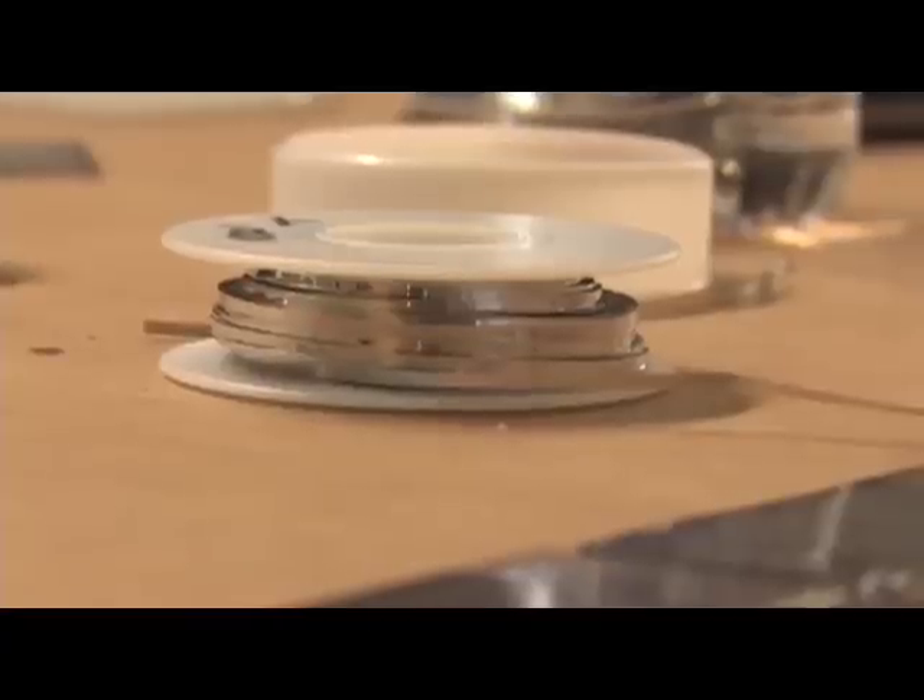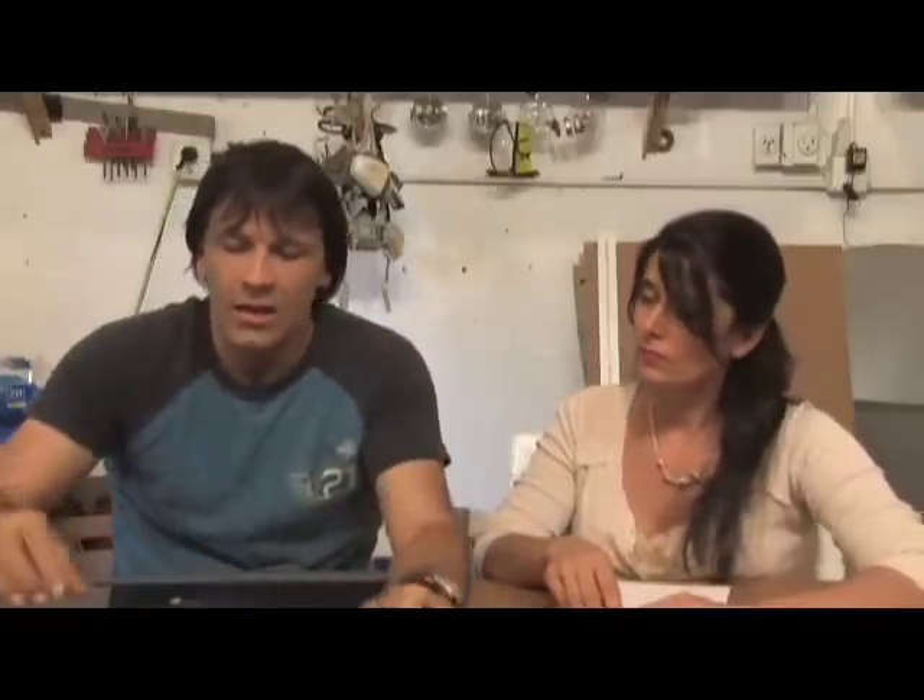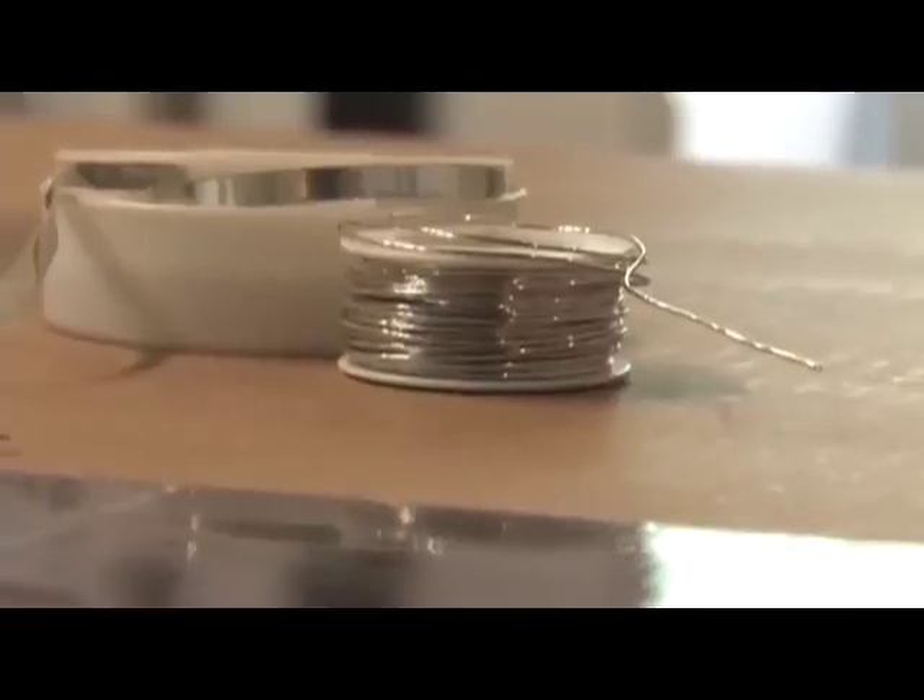What we're going to be doing is tabbing these cells together today. There are basically three different things that you need for this. You need tabbing wire, which is a thin wire that's got a deposited metal on it — this actually solders to the cells. There is also a bus wire; it's basically the same thing as tabbing wire but a lot thicker, so it handles more amperage, and you use this to tie your strings of cells together. There is also some silver solder, which you use to enhance the soldering joints. You're also going to need a soldering iron — they usually recommend a 65-watt iron, but we're going to use one a little bit less than that.